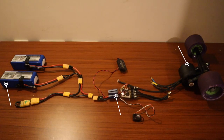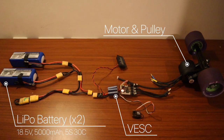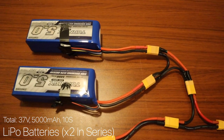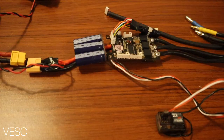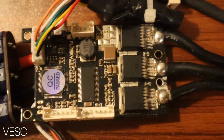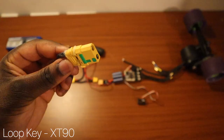Assembly of parts. Here are the bare bones of the electric skateboard, but the question is how do we go from this to that? We'll need two LiPo batteries, both in series — this will give us a combined voltage of 37 volts, connected to a VESC. The VESC is the brains of the board — it's an open-source programmable electronic speed controller which regulates the output of the motor, pioneered by a person called Ben Vedder. We also have the motor and pulley attached to the trucks of the board, and lastly a loop key to complete the circuit.